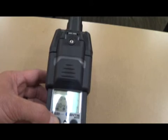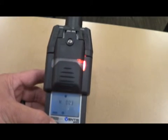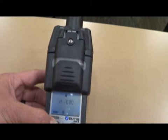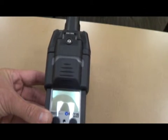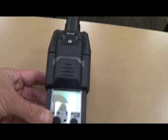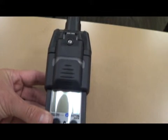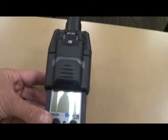To turn the unit off, it's the same button on the left — you hold it down. You'll see a five-second countdown with audible and visual alarms, and the unit shuts off. It's pretty simple — basically firefighter proof. We just turn it on, turn it off, and zero it. This unit will be here at Station 72 on engine 72, and the MSAs will go to engine 74, so that all frontline engines have some sort of four-gas monitoring on them.